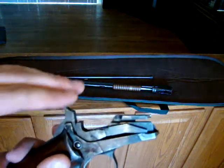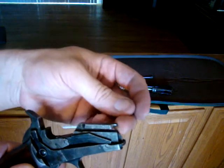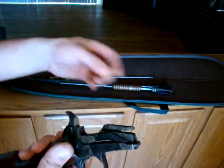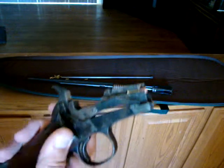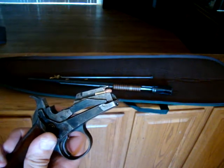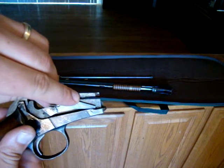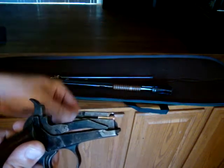This particular action works via the elevator assembly. When it's down like this, this cavity is open to our magazine tube. The spring pressure from the magazine and follower drops a round in here, just like that. Being as this is a .22 short, you see the nose sits right there at the end. If chambered for .22 long or .22 long rifle, this ledge would be cut back further. Since it's .22 short, that's how it fits.